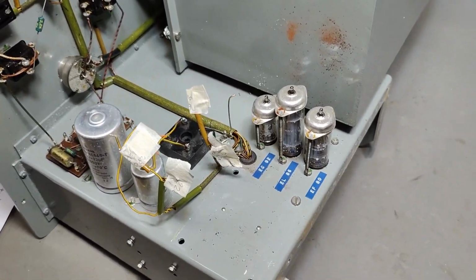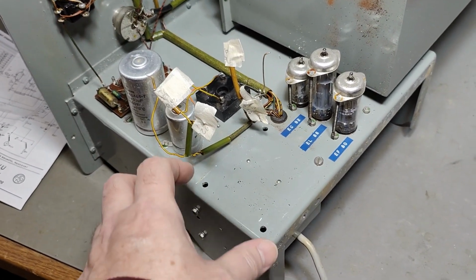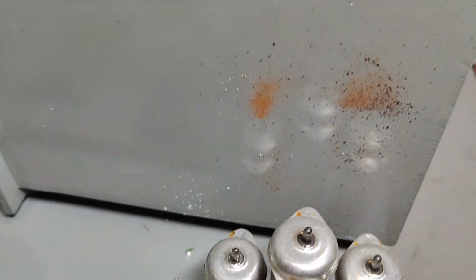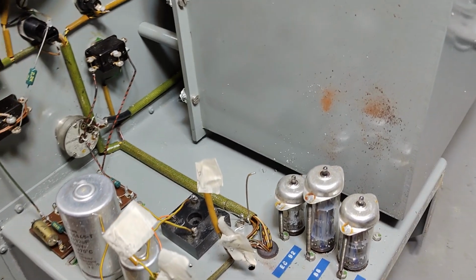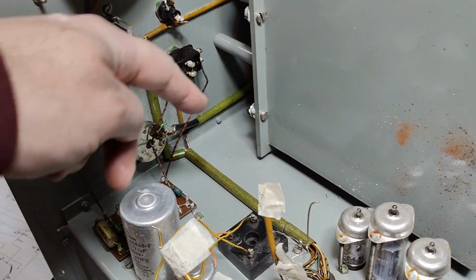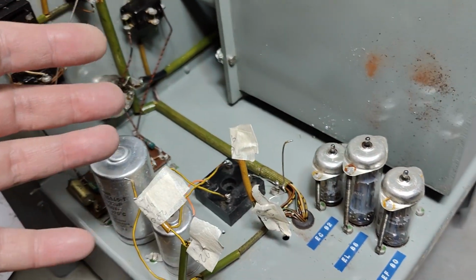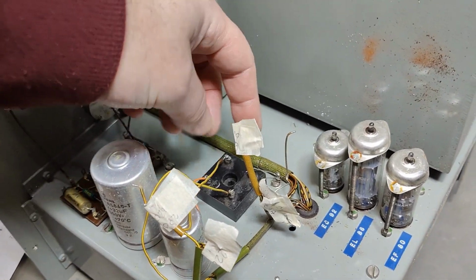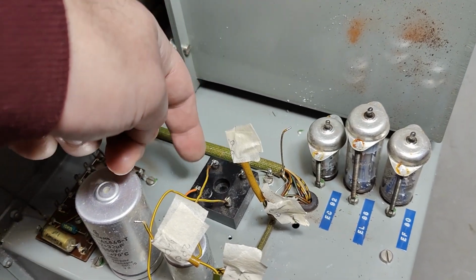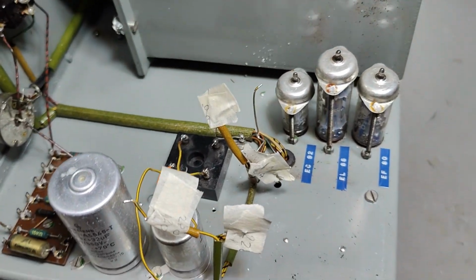We're now inside, and the mains transformer has been removed. And it looks like there's evidence of a minor explosion, and that is also what I was told. We have all sorts of debris pieces all over the place. So I don't know, how is that possible? Or is it half of the high voltage rectifier that was mounted here probably? Here is a new, more modern power rectifier.